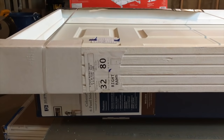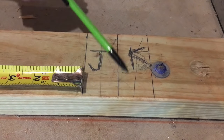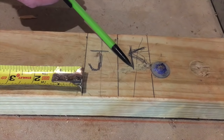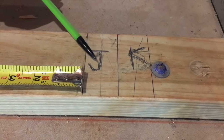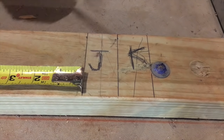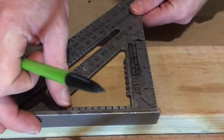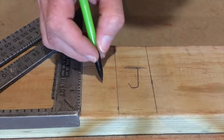Here's the door that I'll be making the rough opening for, and I've marked for two different stud locations. This first stud is often called the king stud — it's going to be a stud that continues all the way up to the floor joists. This stud is often called a jack stud. These two studs are sandwiched together. The jack stud is only going to go up to the top of the door, so 82 inches in the case of an 80-inch door. Now measure and mark the other side of your doorway with the two stud locations — your jack stud and your king stud.